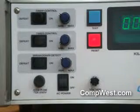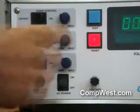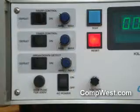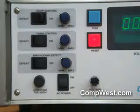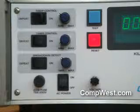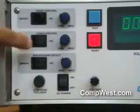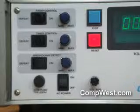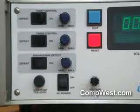To vary the test time, vary the timer control. Values of between 1 second and 1 minute can be set with this control. Test time can be defeated by pressing this switch. In this mode, the test time is 0 and the tester outputs voltage only while the test switch is pressed.